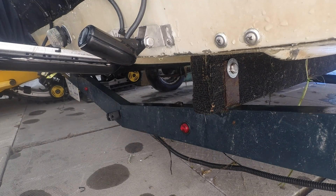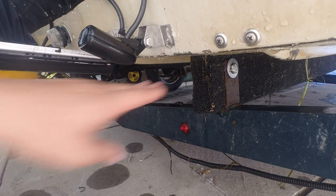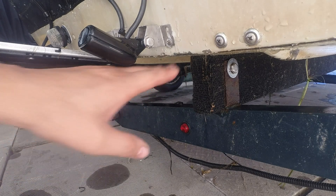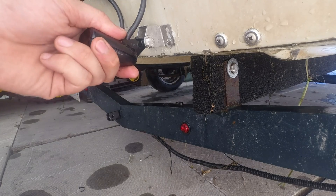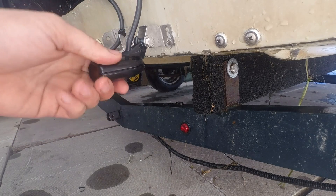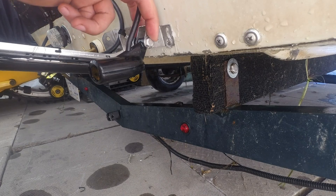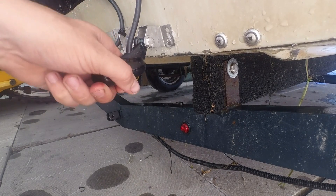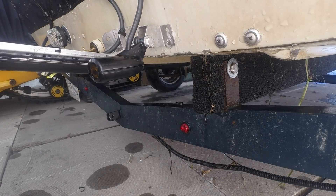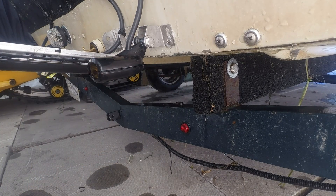With the boat out of the water, you can see the transducer has kicked up really high — so when you had the flow of water coming over it, it wasn't giving you a reading. When you're at rest it's obviously underwater, giving a false reading because it's sending the signal sideways. What you need to do is just click it back. In this case the transducer was too loose, so I've tightened it up so it stays steady in the socket. You should have to put a fair bit of pressure for it to ratchet in its mechanism.